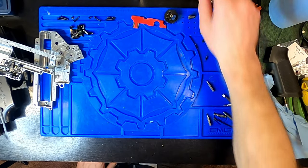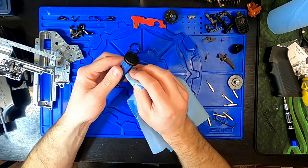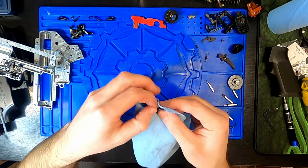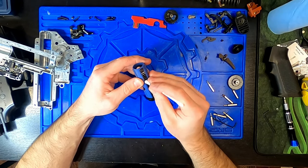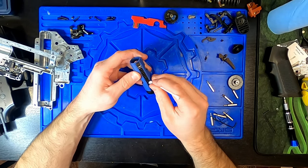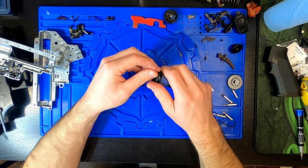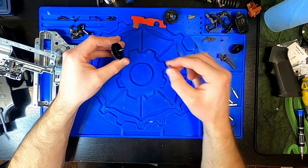Check the tappet plate fin for abnormal wear or rounding. As you take out the piston, observe the teeth and the rack for signs of pull-out, loosening, or wear — especially the pick-up tooth. Make sure the piston head isn't coming loose; if it is, just tighten the screw. You could also use Loctite. Check your o-rings and seals visually for signs of flattening on the edges, and if they're worn just replace them. Rubber may harden with age, so if they're not soft or pliable, replace them.